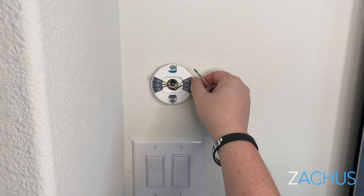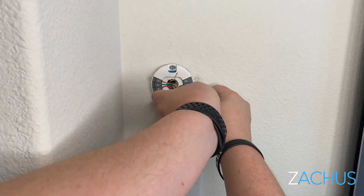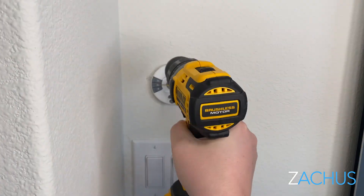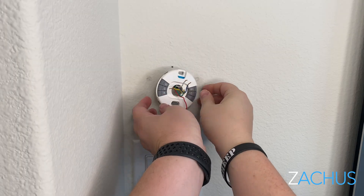Once you take your picture and label your wires, get everything organized so you're not going to lose anything. Then, depending on what kind of thermostat you have, it may have push-downs to pull the wire out, or it may have screws. You'll need to assess that situation — maybe you need a little Phillips-head screwdriver. Loosen the wires and get them all in the middle. Then take your screwdriver or screw gun, pull out the screws that hold your old thermostat, and set it aside.